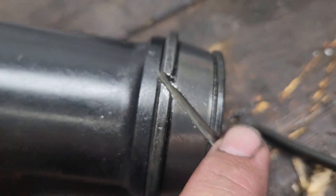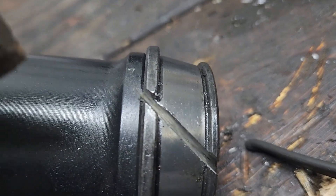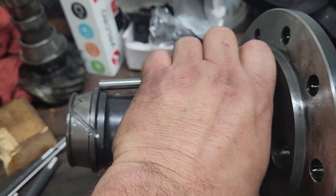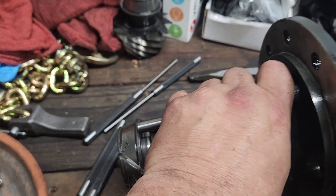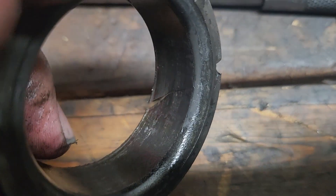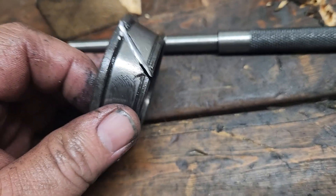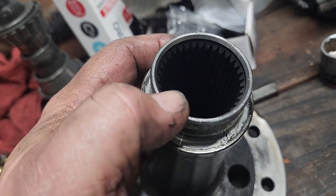Alright, doing the other side. We're just grinding and then using the chisel again - beat on it with the big hammer until it cracks. It'll get weak and it'll crack right through the middle and then you can get it off. I'm holding this up and hitting it with a hammer, and it's moving. Let's beat it off - hitting it on this side, flip it over, put it through another hole, hit it. You can see where it cracked in the front. That was enough to get it to come off. I did get into it a little bit, but we'll just run a piece of emery cloth over it.